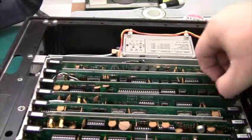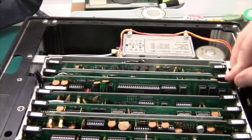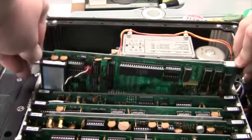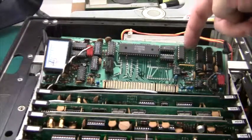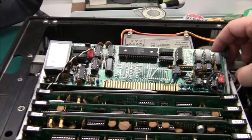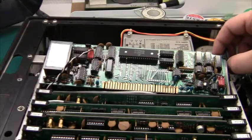The next one is the gate generator — this is where the power is measured if the chip is available. Let's get that out and check if all the chips are populated. Yes, but — look up here — there's a chip missing. So to convert this board to power measurement, it's just a matter of populating this DAC and a couple of other resistors.